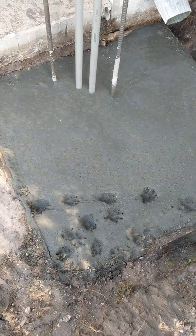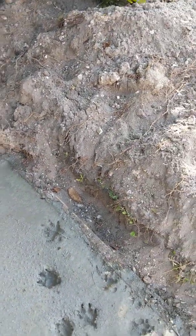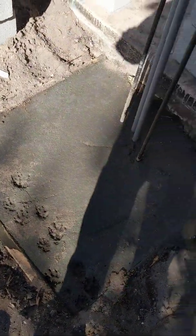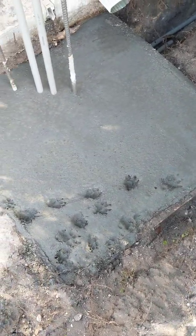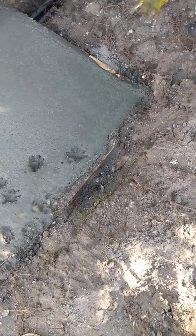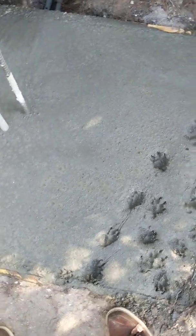What I have here is a 36 by 36 inch foundation. I want you to notice the foundation is about two to four inches below ground level, because when you're done you're going to cover the dirt back over the foundation — so you're not going to see the foundation, just the column coming up out of the ground. I built the form with two by eights, stuck them in the ground, and made sure the top of the form is four inches below the surface.